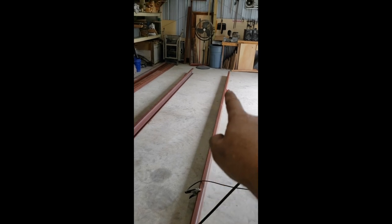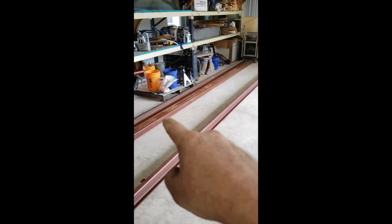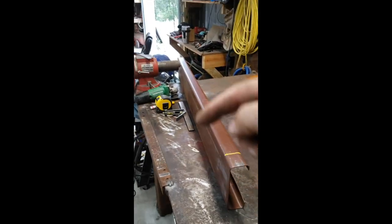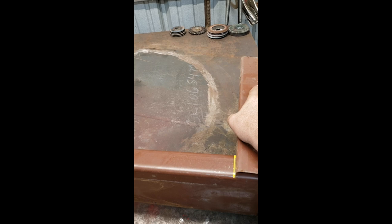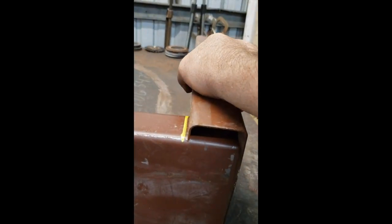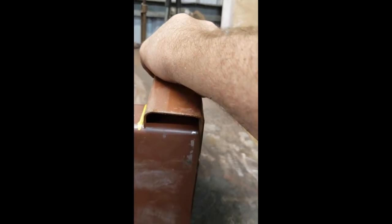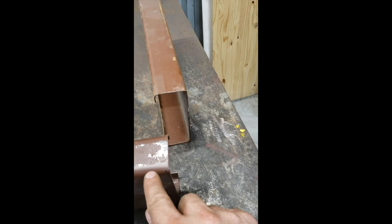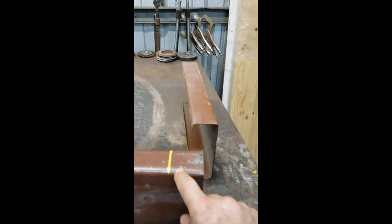The rails need to be as straight as they can be — you're not going to bend two-inch by quarter-inch angle iron very well. I've got this 45-inch end cap piece cut, and I want to show the notching process. Rather than just notching a small bit, I'm going to cut that whole piece out — mark it, square it off, cut the whole flange out — so the end piece knocks in flat and I can weld all the way around, nice and tight. That's the plan.